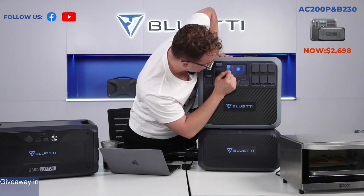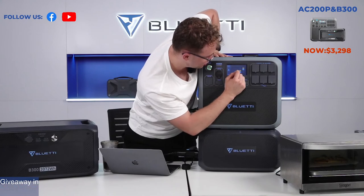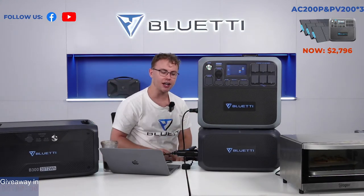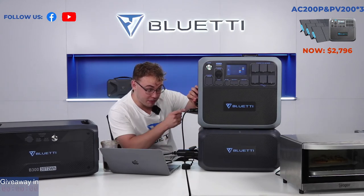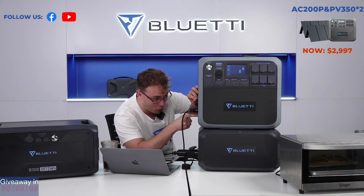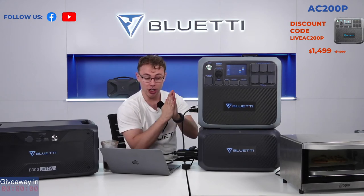Then we have to go to settings and set this one to PV. DC input source, PV. Why PV? Because we use this aviation plug to X90. It uses PV input. Okay, so it's PV, 35 to 150 volts and 12 amps max. So this is the open circuit voltage, 35 to 150 volts. Important.